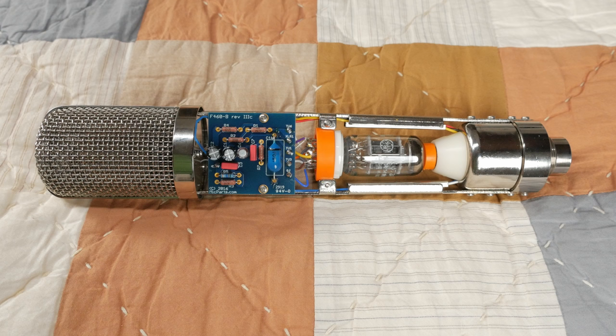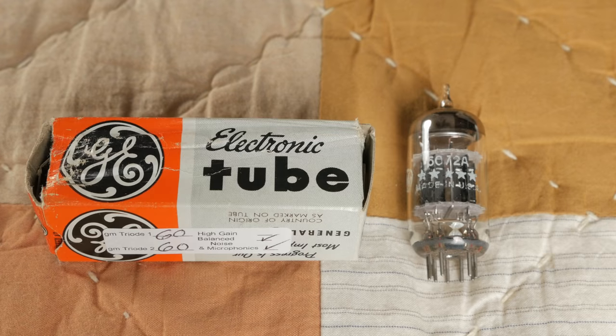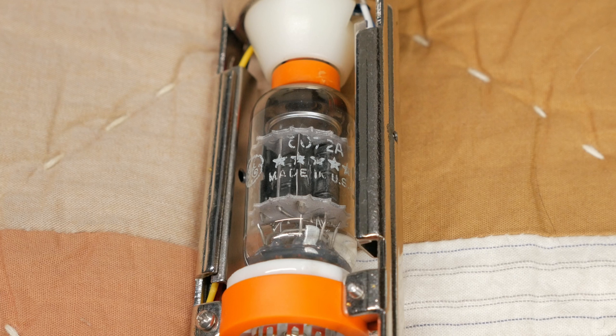There have been upgrades to both the circuit board and part types of the microphone PCB since I purchased my kit. In particular, the filter caps on the B side of the latest circuit board have all received upgrades. The custom-wound T14 transformer is made in the USA and is designed specifically for this circuit. The kit includes a low-noise and low-microphonics Russian 6072, which works perfectly fine. If you want to go all out, you can get a new old stock GE 5-Star 6072A — considered the best tube you can put into this build. I think that's a notable improvement, but the improvement is small — about 5% better.